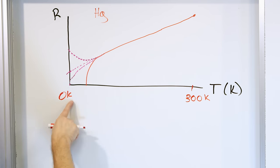All right, now before I forget, we've mentioned that superconductors have a critical temperature, right? We call it TC, critical temperature. Well, actually, there's some other things that you can do to superconductors to make them lose their superconductivity, that are different than just the temperature. It turns out that if you have a superconductor in the superconducting state and you put too much electrical current through it, then the superconductivity will stop. And that's called the critical current density.